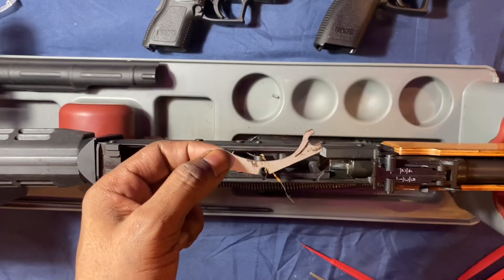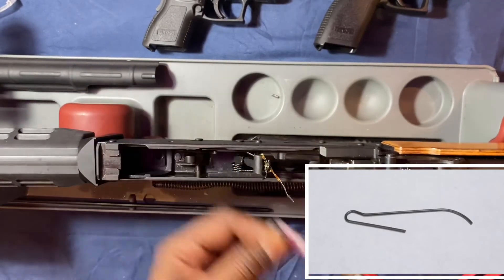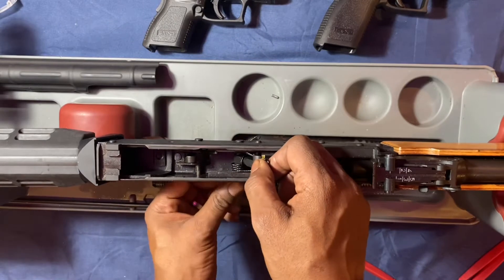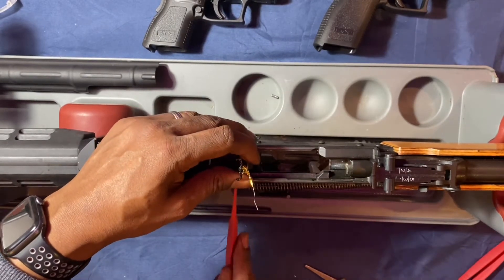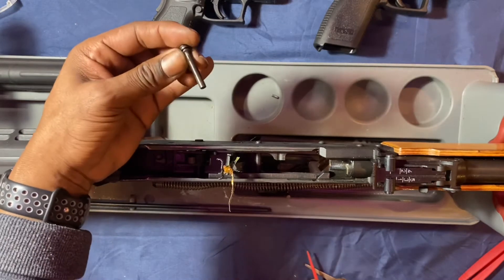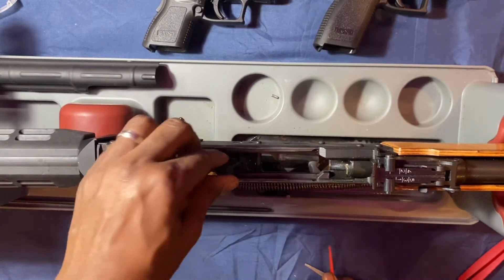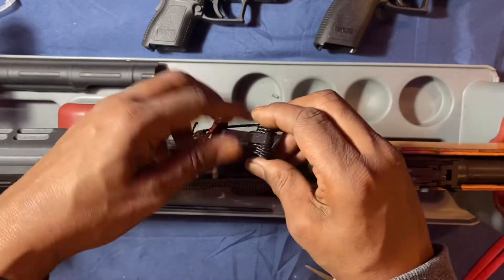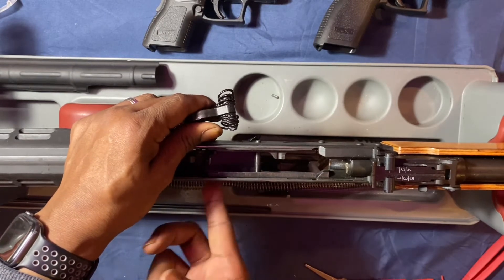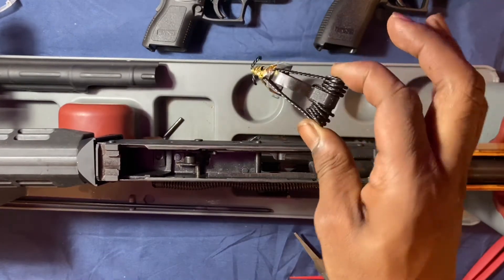What I did was replace that stupid shepherd's hook with this retaining plate. Throw it right down in your tray — you don't have to worry about losing it. Once we got the retaining plate out, we can push these pins out because the retaining plate is actually holding the pin in. Do a little bit of moving around, get the first pin out, drop it down — that is the pin for the spring, and just like that you got your spring out. Wiggle the pins, hit it with the punch at the same time, and bam — just like that you got your hammer out.